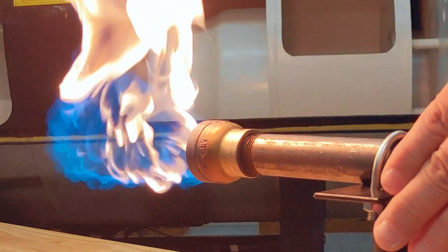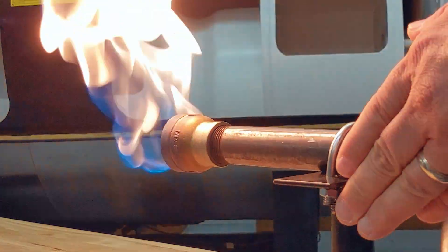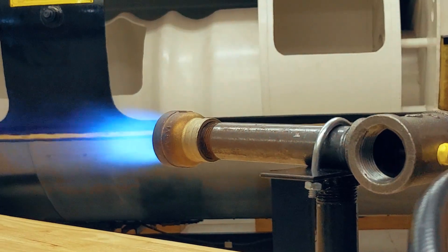In a previous video on combustion you can see quickly how even a slight change in the burner's air supply can starve it of its air requirements. The results are a near-instant change into a reducing flame that is essentially consuming but not burning the same amount of fuel as the efficient flame.